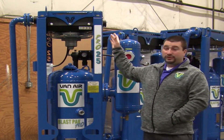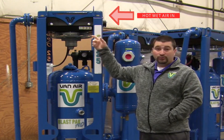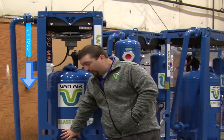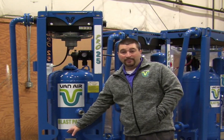The basic operation of this unit: we send hot wet air into the after cooler. The after cooler cools it down to close to ambient conditions. We then send cool air down into the dryer tank. From there, this is where all the magic happens on this dryer.